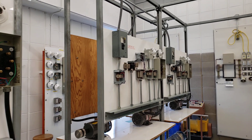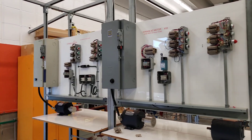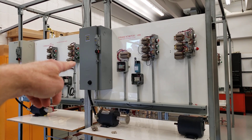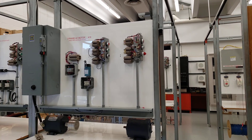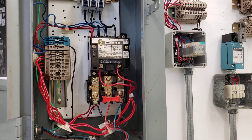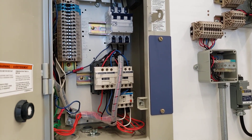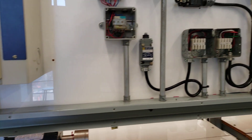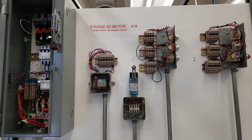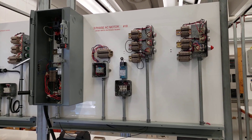There are eight different DC motor stations here. Turning to the right, we have a number of three-phase motor stations as well. On each of these stations we have a disconnect, a relay similar to the whiteboards we looked at before, and limit switches and push buttons. Inside each of these disconnects is either a NEMA contactor or an IEC contactor. These allow us to do forward and reverse on the three-phase motor below, and you'll work through all the various ways to control this motor using two-wire, three-wire, and forward-reverse, and understand the different interlocks available on each unit.